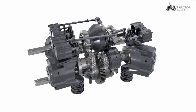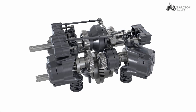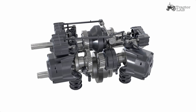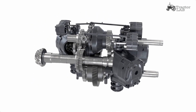What is so revolutionary about it? A variable four-wheel drive thanks to independently driven axles and without any intervention by the operator whatsoever. How does it work? The drive unit on the Fendt Vario Drive works according to the principle of hydrostatic mechanical power splitting.